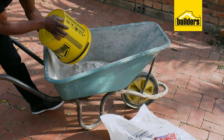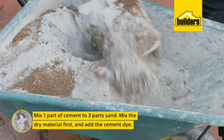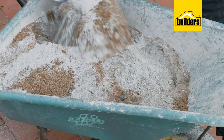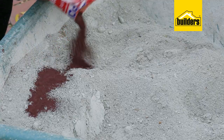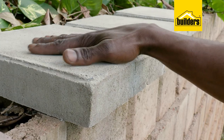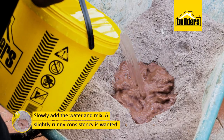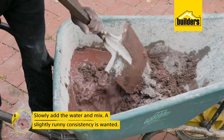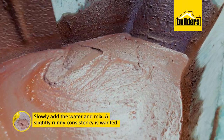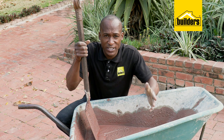I'm using a 3 to 1 mix, which is one part cement to three parts sand. I prefer mixing the dry material first before adding water to ensure we get an even mix. I'm going to add the cement dye at the same time — there are a few dye colours available. These pavers here are made without any dye. Now slowly add water and mix. You can see how the dye immediately changes colour. I purposefully want a slightly runny consistency to ensure even coverage within the moulds.